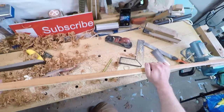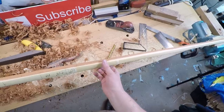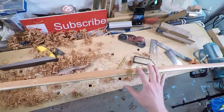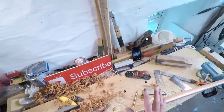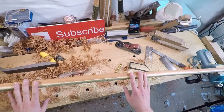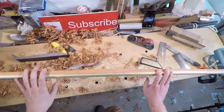No, and let's take this mask off so you can hear me. Every bow is different. Every piece of wood is different. Every piece of wood and every bow will throw up different problems. And every time you tiller a bow, every time you get a piece of wood to bend, it's different. It will react differently, it moves differently. You will never, ever, ever tiller a bow that's the same again. Every bow you will do will be different.